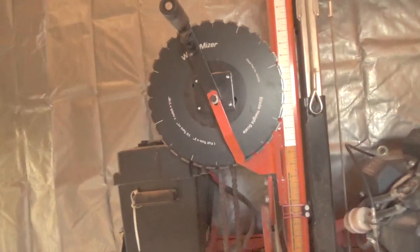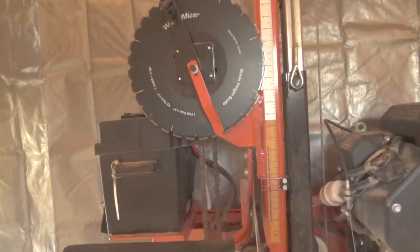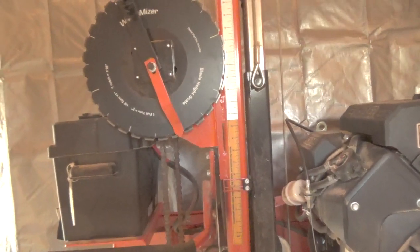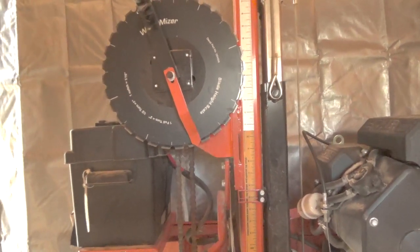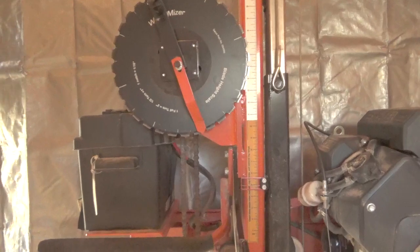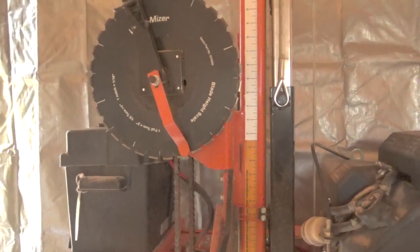What you want to do then is, say when you're cutting a cant, let's say the top of the round log is 12.5 inches off the bunk, what you may want to do is figure, okay, I'm going to go down to 10 inches. That'll be like a 2-inch cut, 2.5 inch cut. And then once you get to that 10-inch mark, you can figure out accordingly with inches how far you need to go. So I always try to get to the nearest inch, wherever that might be, or just make the board be an inch so that I can work with it.